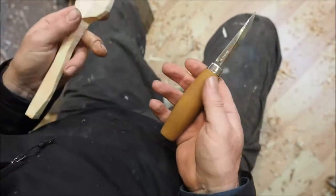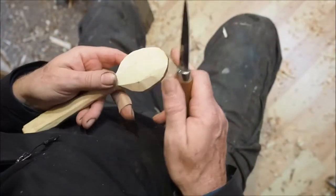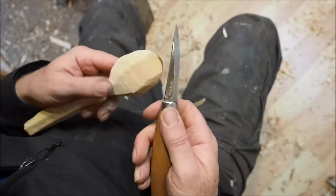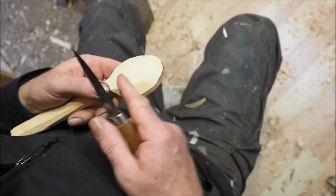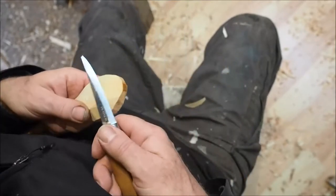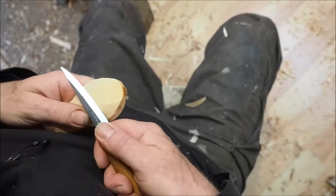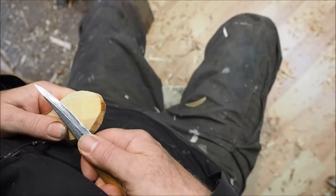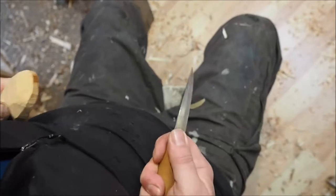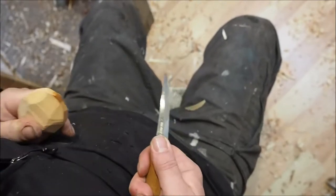The other time chest lever is really useful is where you're going to work across grain a little bit. So the back of the bowl of the spoon is a really good place for shifting material using the chest lever, because you can be very precise where you place the knife to start with, and you see it just engaged in the wood, and then you open your shoulders and you can ping off chips right across the room.